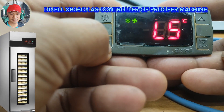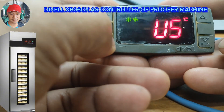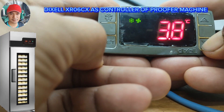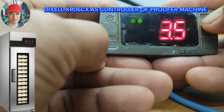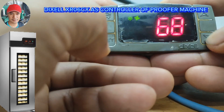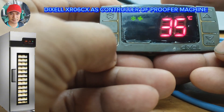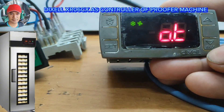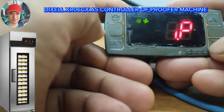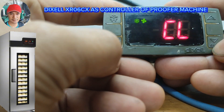After that we're going to change the US. US is the lowest point — wait, LS is the lowest point. 37 minus 2 is 35. We cannot change LS right now, so we're going to change US first. US is our upper set point, so I'm going to change it to 35. Then we proceed to the exciting part — the IP parameter. We're going to change that from CL to OP.